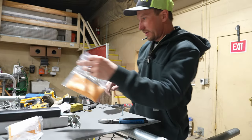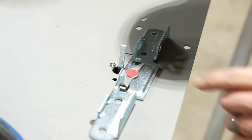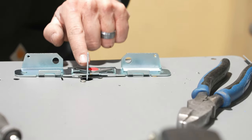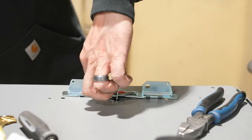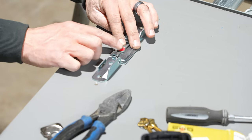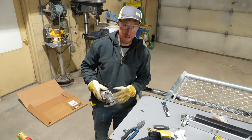We need to get into this bag and pull out this actuator pin. It needs to not pass through or penetrate that red sticker. They give you a whole bunch of tick mark lines right down the actuator pin showing where you need to trim that. I've highlighted with my black marker where I need to trim mine — it is not touching the plate and it is trying to press up through that red sticker. That is not good. With our cutoff wheel, we're going to take just a sliver of that off. This is a very, very critical step.